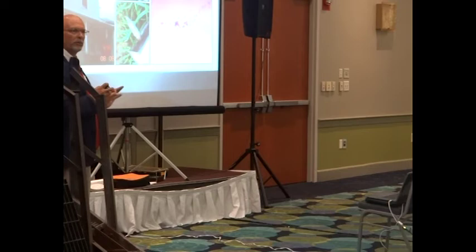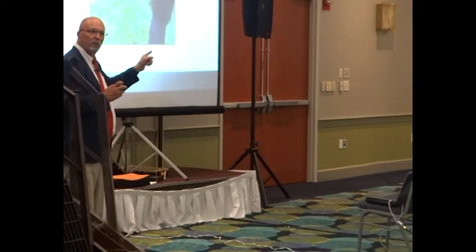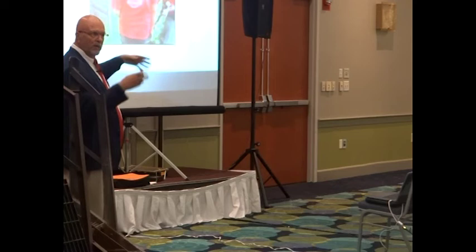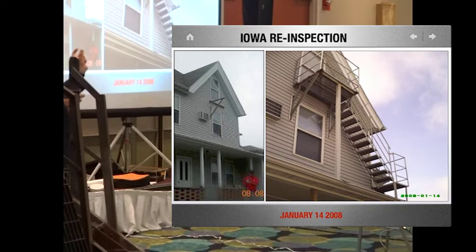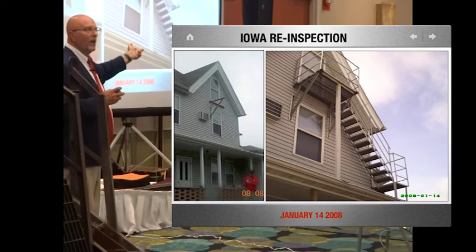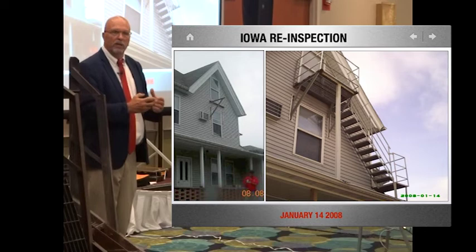This is where they threw the evidence in a field like 5 blocks away. They threw the whole thing that collapsed to the ground while waiting for court cases and stuff. It was in a field. And when we went there, we found the lag bolt still in the bracket. They put it back, and they were so unsure of themselves with through bolts, they actually put a leg on the roof. So they doubled up to make sure it never would fall again. And did they have a sleeper on the roof, or did they just have the pole sticking in the shingle?